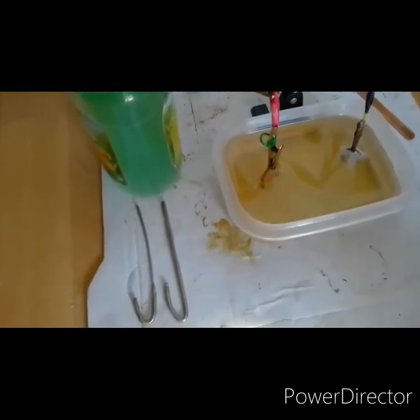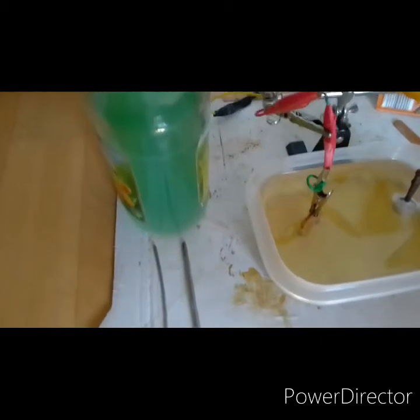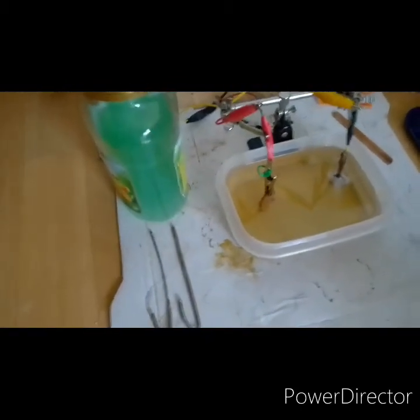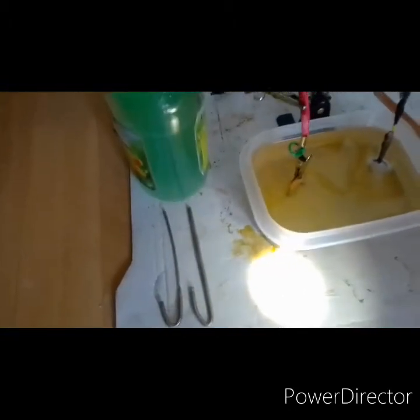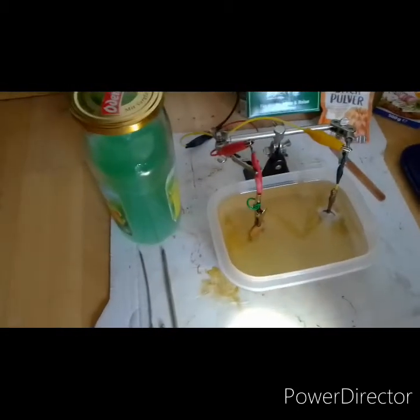This is an electrolyte I've done before — very durable. You use an anode and cathode to make this. We use a welding rod — nickel, a pure nickel welding rod. The left was the anode and right was the cathode. You have to have a little more juice, a little more amperage to get it done when dealing with nickel welding rods. I used a car battery charger. You have to stir it — it's pretty warm if you don't have a resistor in between, which I didn't. I just stirred it and used it, and I'll show you the results later.